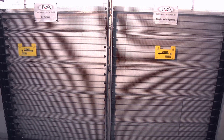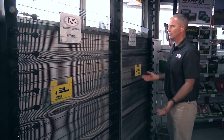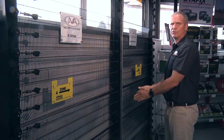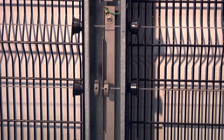What we have learnt at the top end of the market, where we're doing central monitoring with low voltage systems, is that the best place in any taut wire system is to have your monitoring done in the middle. Due to expansion and contraction — we're dealing with steel wire — having your system in the central area of the fence means that any expansion or contraction on either side acts equally on the middle of the fence.